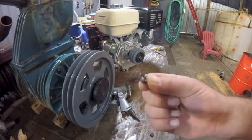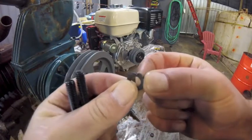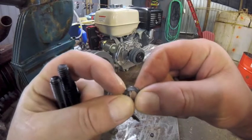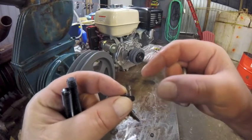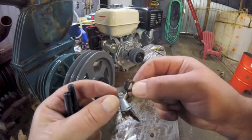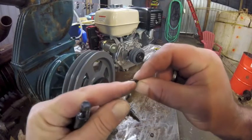Now, the bushing comes with the bolts, and these here are lock washers. I don't use lock washers because of this split. It lets in rain, any kind of contamination, and it's spring steel, so this is supposed to be pushing against the bolt head to keep pressure on it. This design is flawed, and a lot of times these break, and now the part is very, very loose.